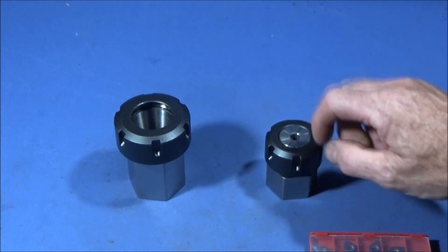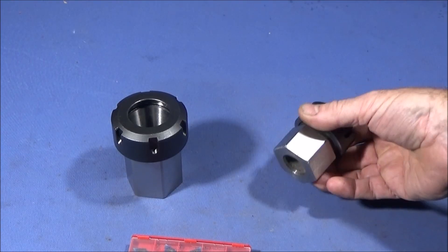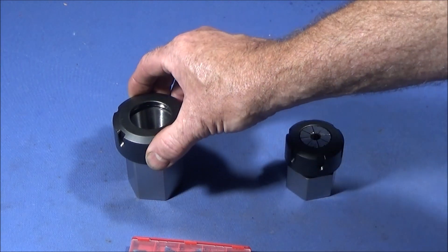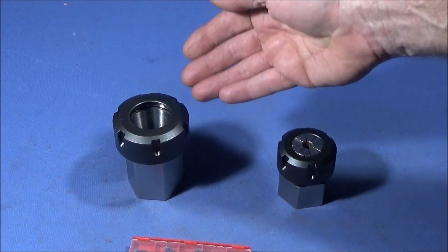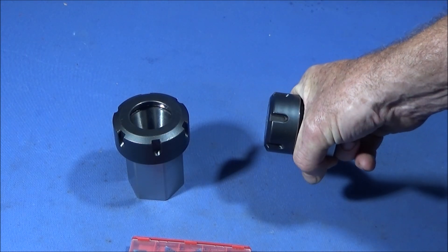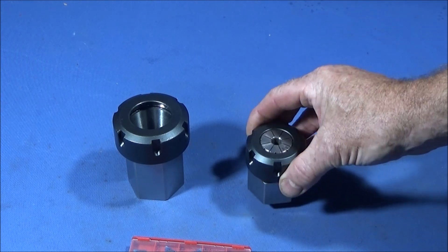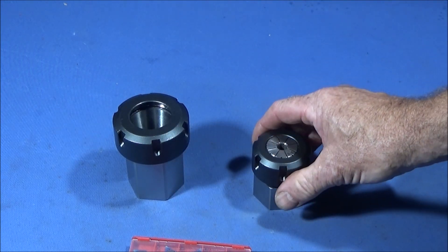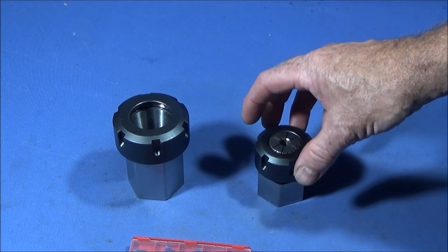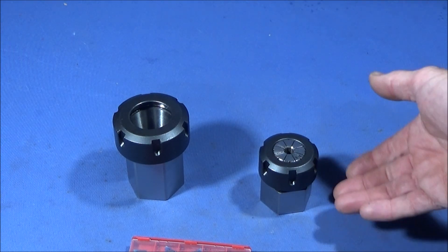This is the safest method of actually removing the back part of the collet chuck, and it's great to have these if you have the actual collets. I've got the ER40 and the ER32 with both sets. It's great having this so you can quickly put it in the jaws — you can hold some thread without damaging the threads, or use it for stock and a backstop. They're really quick to just put up in the lathe in the three jaw chuck and use directly.